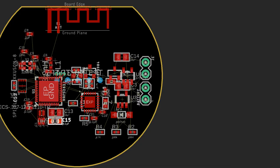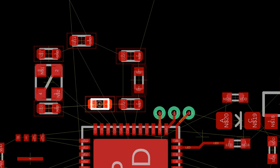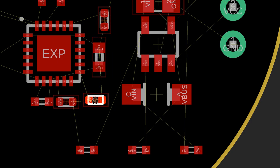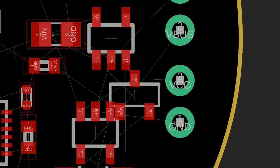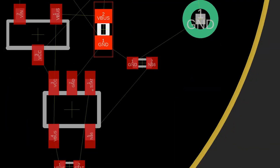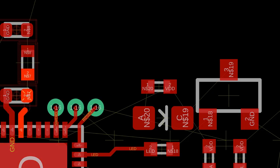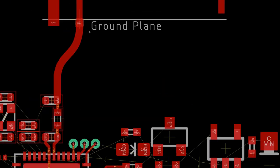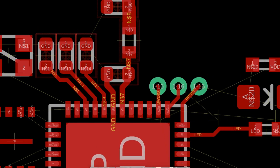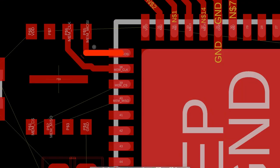I'm going to try and keep the board to a two-layer board, where there are traces on the top and bottom, as it significantly reduces the cost. I'm sticking to parts on one side of the board, again to drive the cost down. The great thing about the NRF series of processors is that all the hardware registers can be mapped to any of the input-output pins. This gives me huge flexibility in how I lay out the design, meaning I can place parts close to the processor and then remap the pins based on my layout. I begin by placing components that can't move, like the antenna and the crystal, then the processor, then the main parts like memory and accelerometer around it.